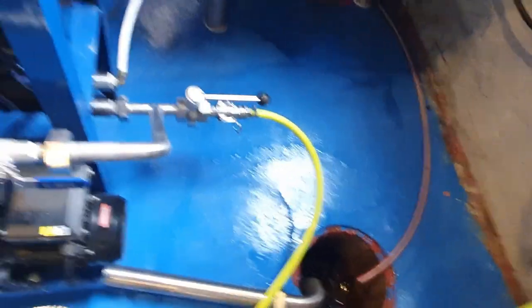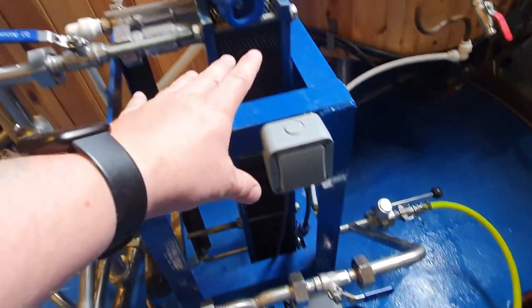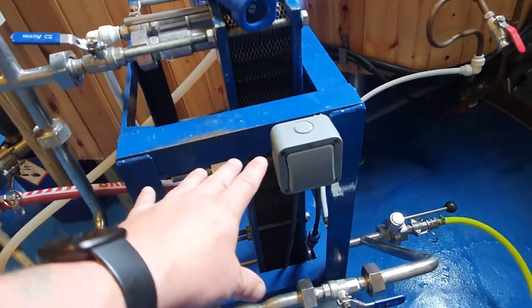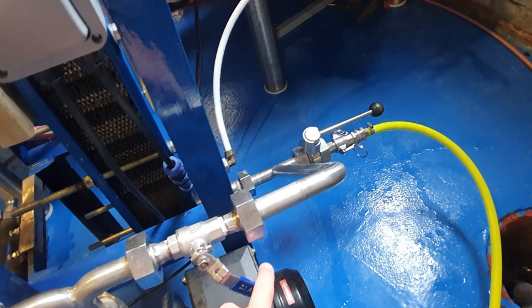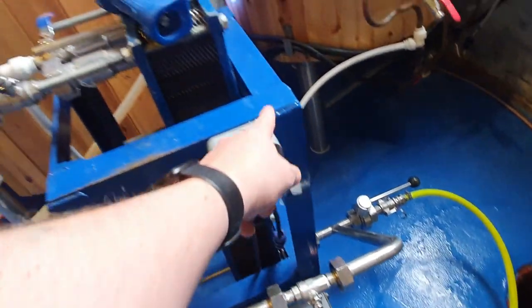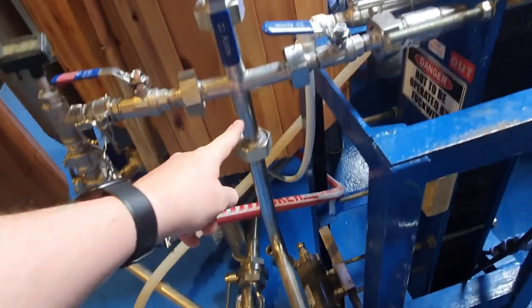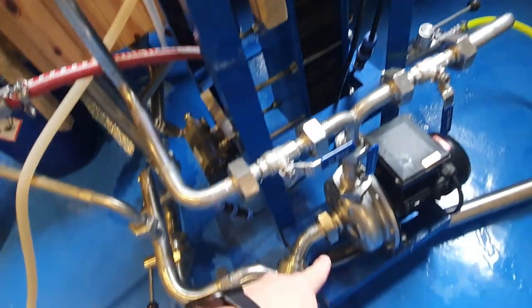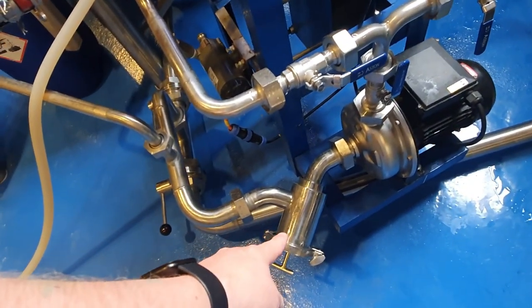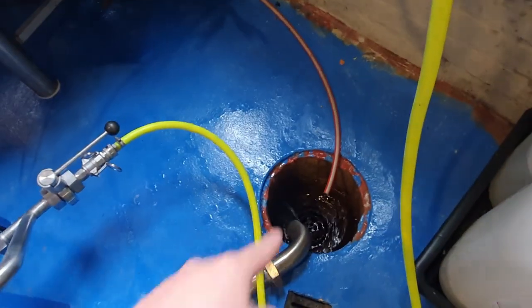This water can be directed one of several ways. I want to rinse out the whole of this plate chiller first, so we'll prevent it coming up this pipe — now it can't enter the pump from this direction. It has to go through the plate chiller, out this top section, run down here, through the pump, rinse out my filter, go along this pipe here, down into the waste pipe, and away down into the drain.